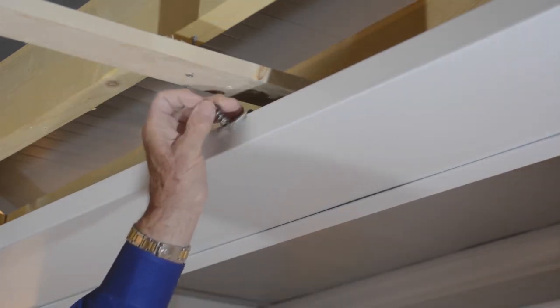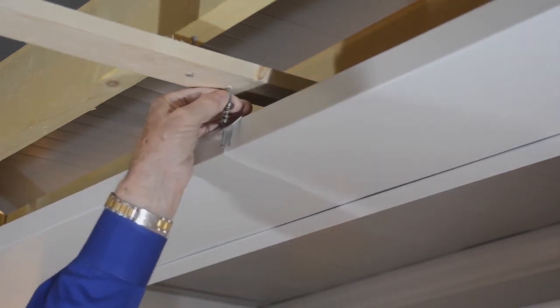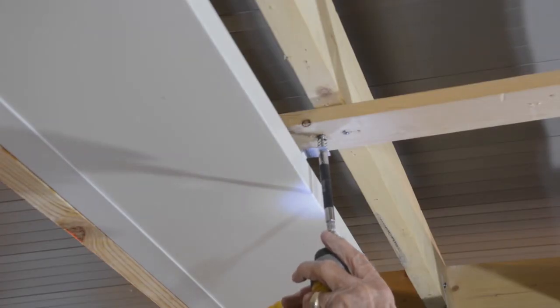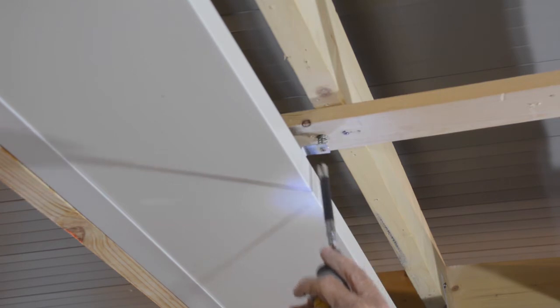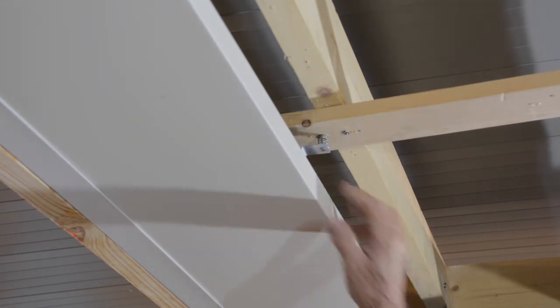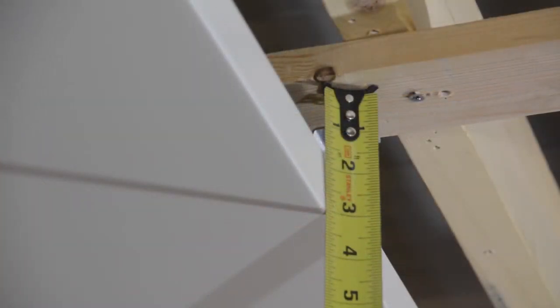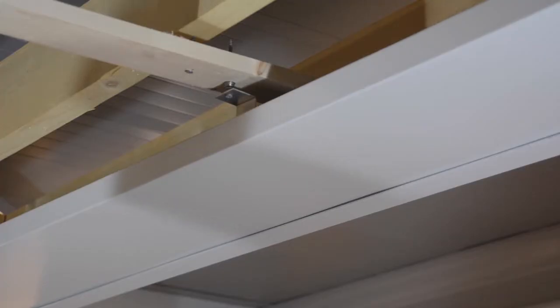The hook on the panel latch is placed under the bend of the panel. Compress the spring until there is contact between the hook and the edge of the panel. When the panel is lifted, the latch swings out of the way of the panel's edge. The top edge of the panel must remain 1 1/2 inches from the bottom of the support board.